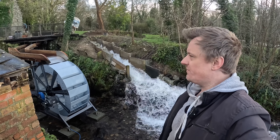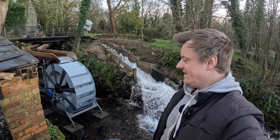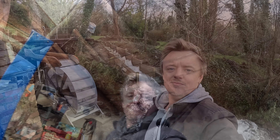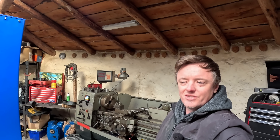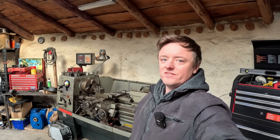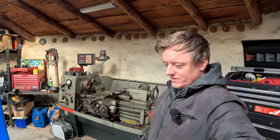So that's all done — welded back up, painted, just got to put the cover back on and that's it. I reckon that is going to be the last time you see this wheel, certainly any time soon, because it's done. Project complete. All working — it's got all its fail-safes and controls and everything. Hopefully that'll be it now, no more problems. I think we've ironed out the teething problems. Project concluded. Back home now — I looked over the footage of that weld and it looks so bad on camera, especially after it rusted. I had an absolute nightmare — I couldn't get in at the right angle with the arc welding rod, the mask wasn't flicking over properly and I was getting blinded, the power kept tripping out, and the rods were quite old and weren't rated for a vertical weld, so they were just slumping off. I'm going to have to go back there with a MIG and tidy it up.